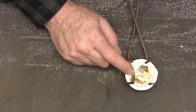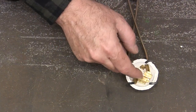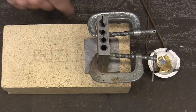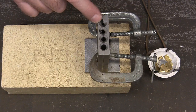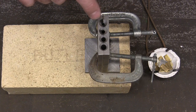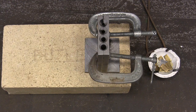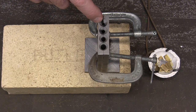This crucible has already been fluxed — I've got a video on showing you how to flux your crucible before you get started. We've got our mold set up on a piece of fire brick, just to keep the heat from sinking out of it into the steel table. We sooted one side, and I oiled this one. You can oil these molds or you can soot them. I'm going to see which one I like better, because it causes a big mess in your shop to soot it.